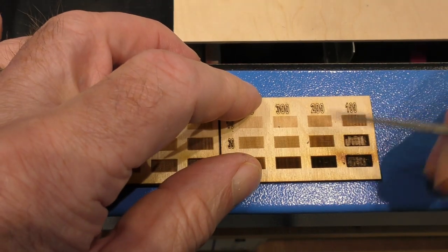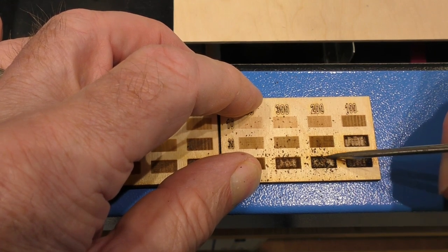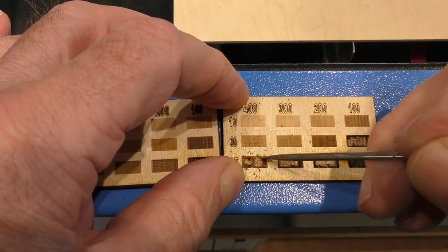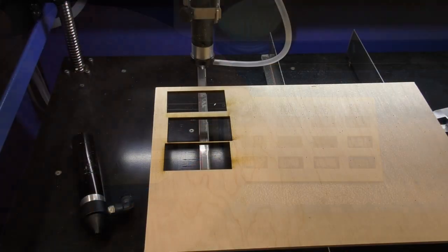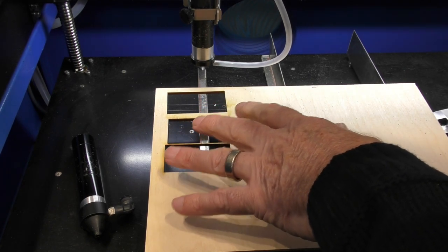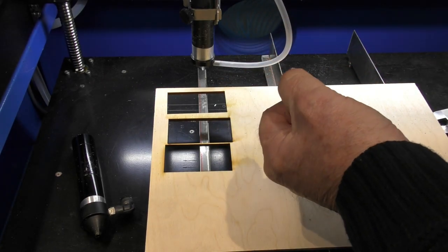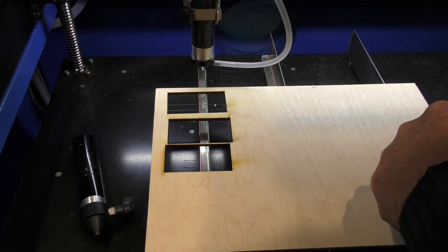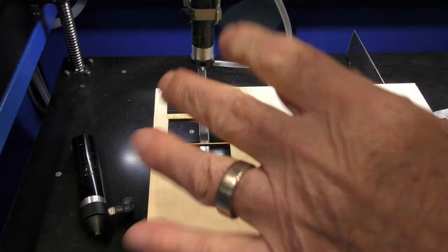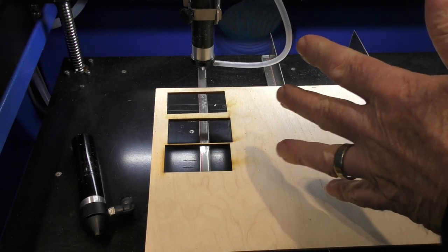So, colour is not what it seems. That's little more than soot, really. Now, people are using these machines to do what they think is grayscale engraving. It's not really grayscale photo engraving at all. It's a strange hybrid mix of taking a photo and making the dark bits deeper than the light bits. Yeah, okay, they're darker, but as you've seen how fragile dark can be, you've only got to scratch it and rub it and it may well flake off.